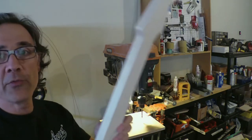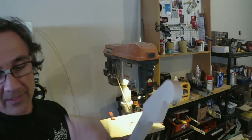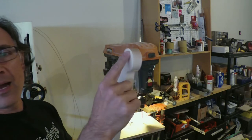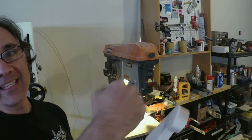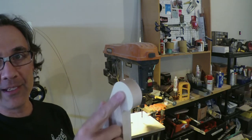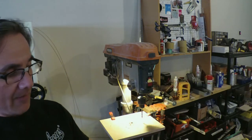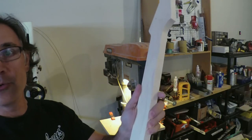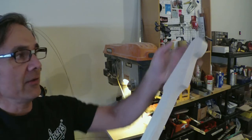I'm gonna go ahead and do that and then we'll be right back. So I just quickly remove the template with a metal spatula. And just a tip, if you want to start the spatula on the headstock here and dig it in and rip it off, that's the place to do it. Since this wood's going to be removed anyway, you won't be scarring anything. If you try to remove it down at the heel end or on the sides, you risk denting your wood and then creating a problem. So you could do it up there.